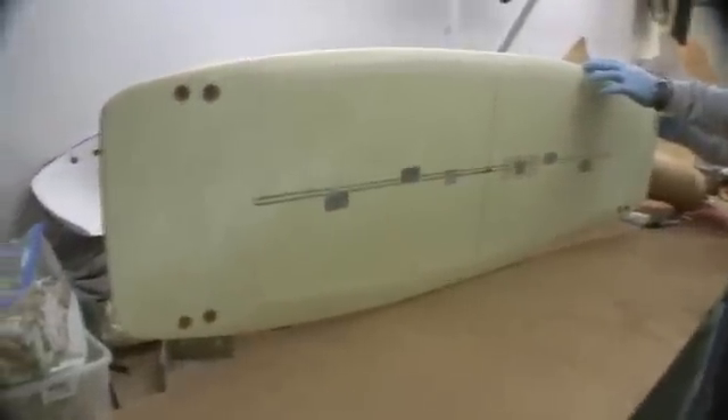Polyester foam blank. Here's where we put supports for fins through holes. These are aluminum blocks that have been epoxied in place. Wax fills the holes in the block. The foam sheet is shaped on the top so you get the profiling edge. Here's the aluminum block close up.